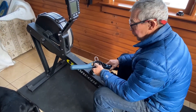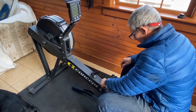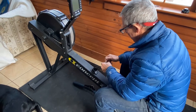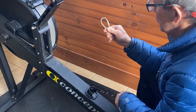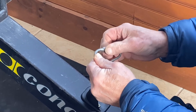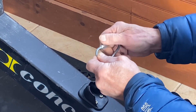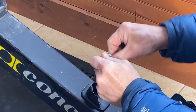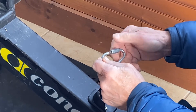Leave it in that position — it'll make for a quicker switch between the two modes. Just leave it under the monorail. Now we'll take the chain back through and thread it back through, then put on this pear-shaped connector. You don't need any tools to fasten or unfasten it — it's hand-tightened. Just turn it; you never want it so tight that you can't loosen it by hand, but when you tighten it you do want the threads completely covered by the nut.